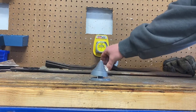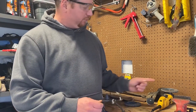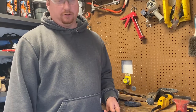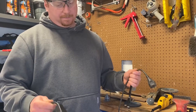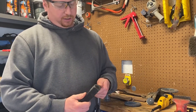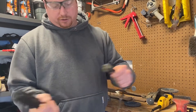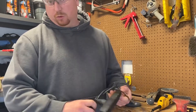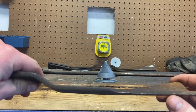A couple of useful tips: we have our tool for putting on the grinder bit zip-tied to the cord. Common sense — unhook the cord when you're changing out your grinding wheels, just be safe. Also, when you plug in an extension cord and go to pull it out, it just comes unplugged — that's no fun. So if you tie a little knot and plug it in, now you're just pulling on the knot and it won't come out on you. Just a little free advice. Let's see what we're starting with on this blade — it's pretty rough.